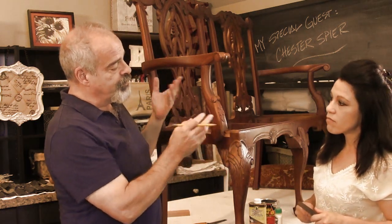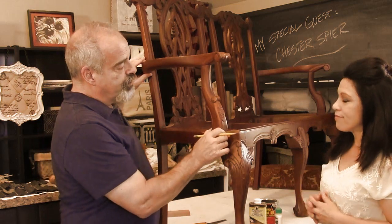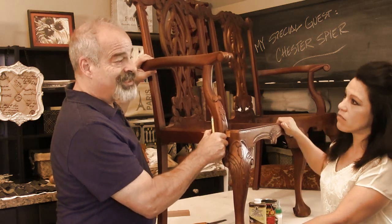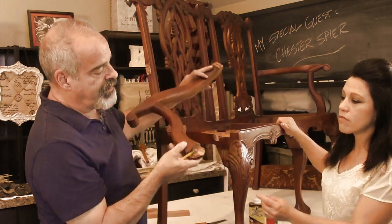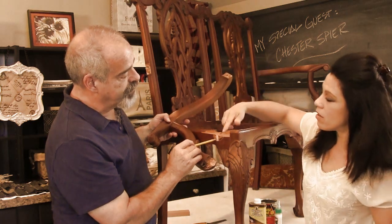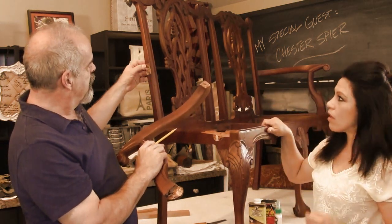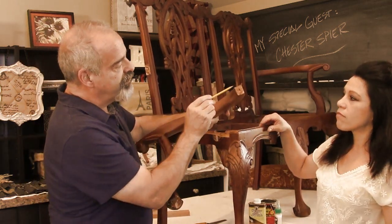What we're going to do is remove the arm, cut away some of this wood, insert a new piece of wood, and then reattach the arm. When you take the piece off you have to be sure not to just pull it off or you'll break more. There's a dowel underneath, so I pull the back out and then go up with the piece. You can see here's the dowel — here's the original piece that stayed, and what we're missing is this whole wedge. There was so much glue that it didn't really break the wood, it broke the glue joint which pulled some of the wood away.